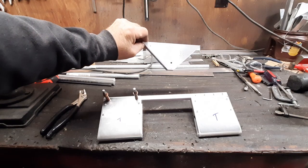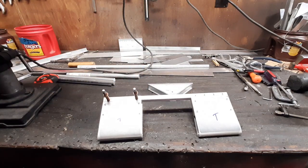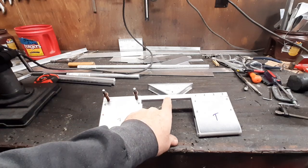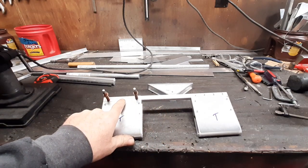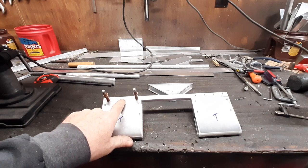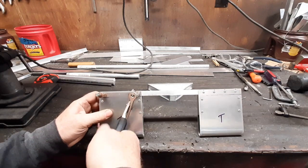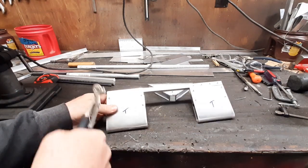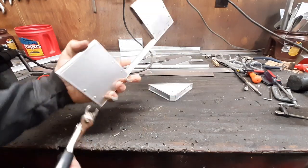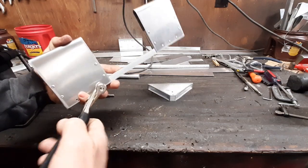There, we've got the hole drilled in the pivot. Now we need to work on the rudder bar that I built the other day. We'll need to put a 3/16 hole in the exact center of it, and then also put a hole over here for the connecting rod. I left one side unriveted so we can just pop it off, slide it through, and fasten everything up.